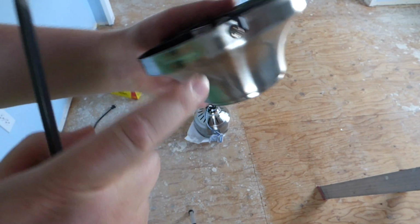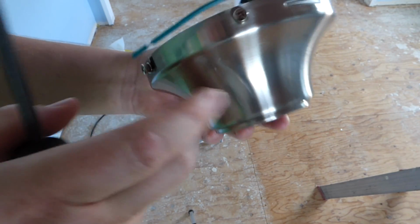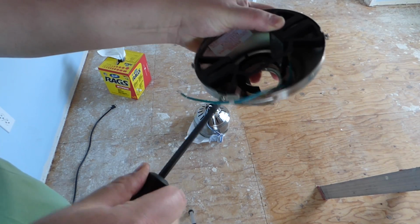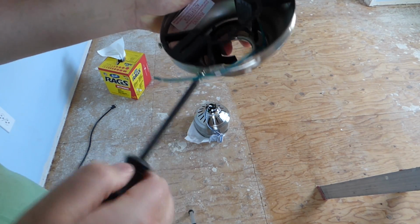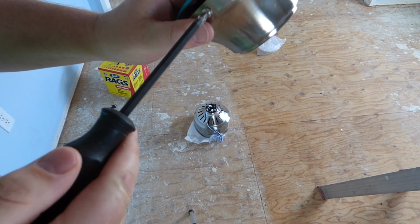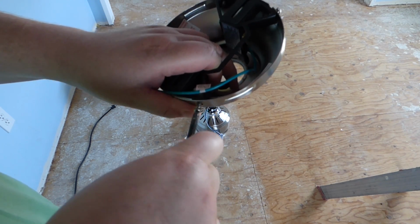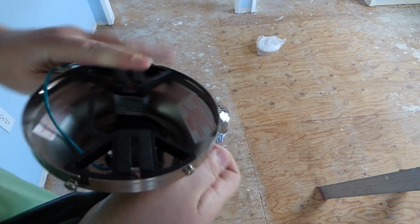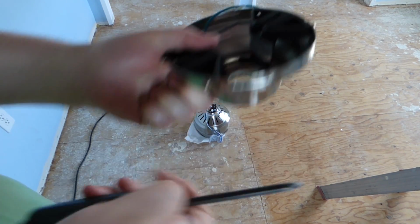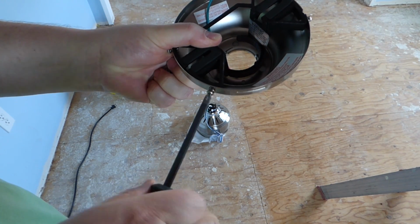And you take this screw here and loosen it, and you see a little J marker on it. And you take this screw here and you take it out. Number 2 Phillips, right? And then the other side, same thing. There's one that you will loosen and one that you will take out and keep. And you keep those screws somewhere safe. Then, after you get that separated, we'll take the bottom part.